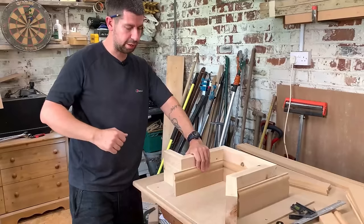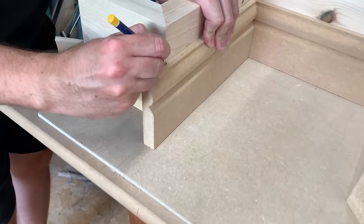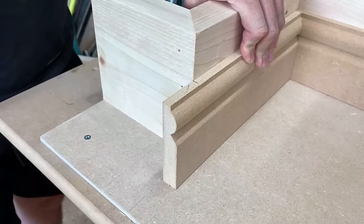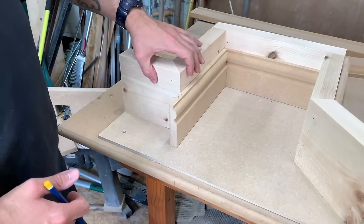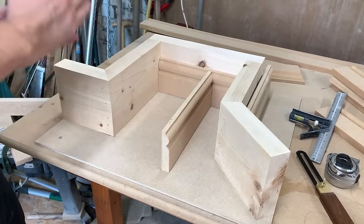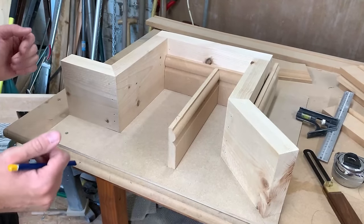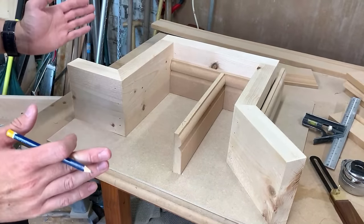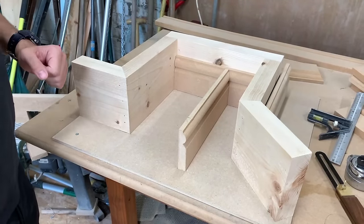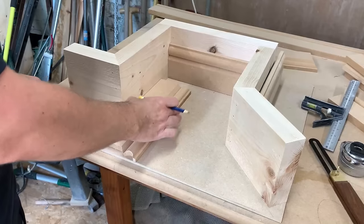Since we put this piece in we might as well follow around the corner. We've got a 90 degree-ish external angle. We just want to put a mark at the end of the wall there and then put a reference mark so you know which way you need to cut the skirting board. That might not be exactly 90 degrees — on most houses they're not. So how do we work out what angle we need? If it was 90 degrees we'd half it — cut 45 on this piece, 45 on the other and they come together at 90 degrees. But if this is out by a couple of degrees it'll be gappy and no matter how much caulk you put in it'll always look like a bad job. So get a piece of skirting board or anything that's parallel and if you can draw on the floor, great.